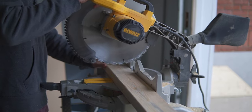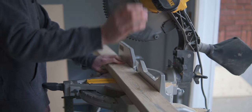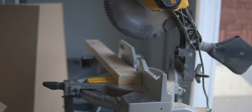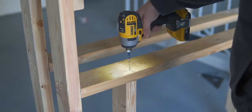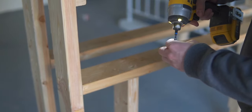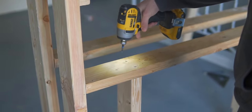For the last part of the frame we added side pieces for the inside of the fireplace hole, which we wanted to be 31 inches tall. We cut four identical pieces of 2x4 at 31 inches, and in the back we cut the same notches as before so they would fit over the baseboards as well.